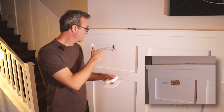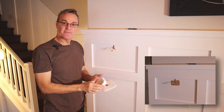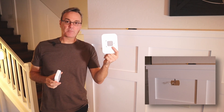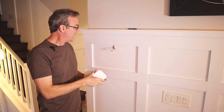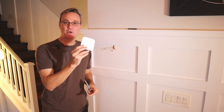It's very possible when you get the old unit off that there's going to be some scarring underneath it, and the new unit is relatively small so it might not cover all of that. It does come with a scar plate so you could put that underneath and then mount the new unit on top. I don't think it looks as nice though — I have some touch-up paint so I just used that and went with just the thermostat itself.